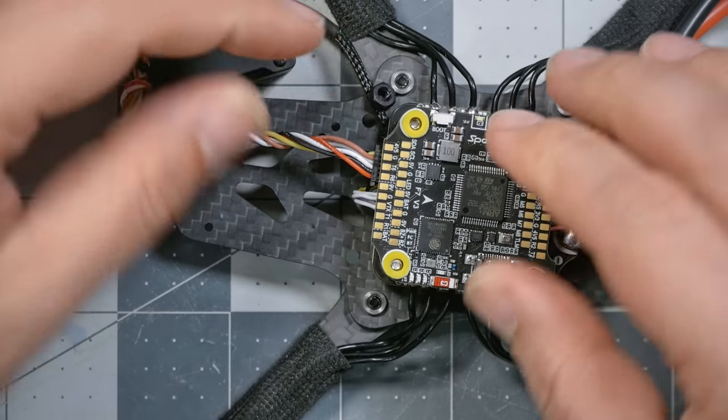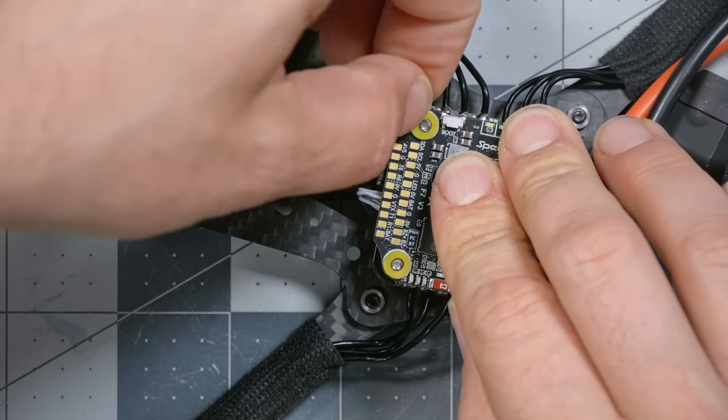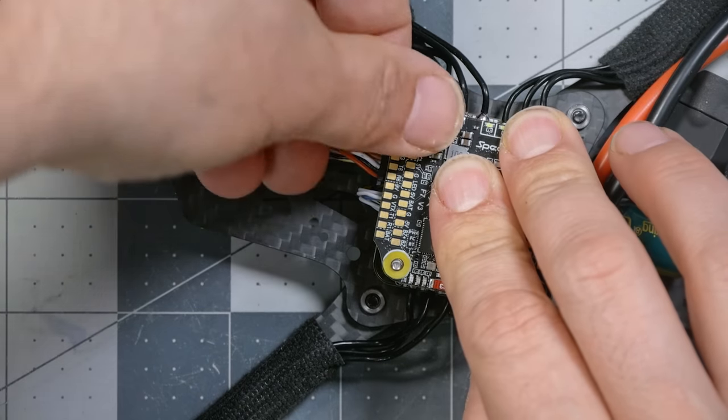The screws for the Vanover build seem like they are just a hair short of what this Speedybee stack really wants. I'm having to compress these gummies just a little bit in order to get the screws to bite, but I think it's going to be okay. If you over-compress those silicone gummies, then you'll hurt the vibration isolation characteristics a little bit.